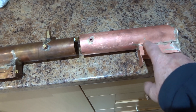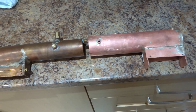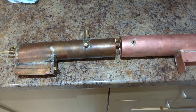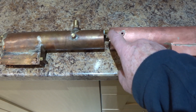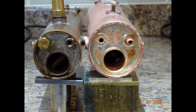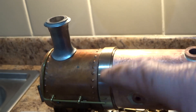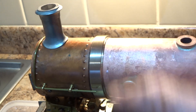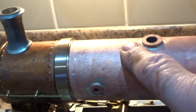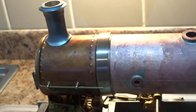My new revised boiler for the 084 is now made. Hasn't been tested yet, but it's made. Just for comparison, that's the original boiler which I made for this engine. Second time around I've used a larger diameter tube. Frankly, with considerable difficulty — I don't know whether it's brass or bronze, but it was a hell of a difficult thing to machine — I've turned up a mating ring to mate the revised boiler to the original smoke box. Will I regret this shortcut? I do not know.